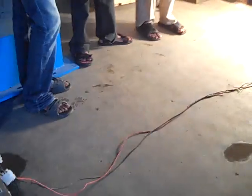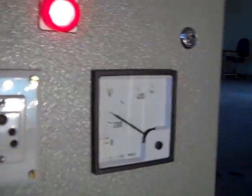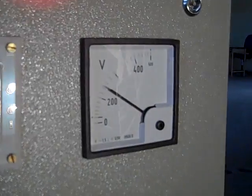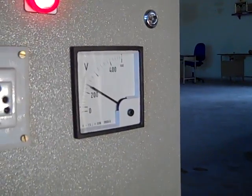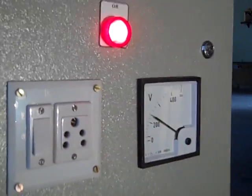You can see here the voltage is kept the same as it was earlier — the user always sees 220 volts all the time. So despite a change in load, the voltage is kept stable. That's the role of the electronic load controller.